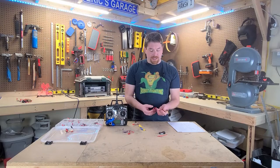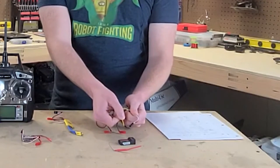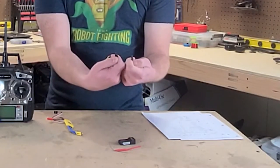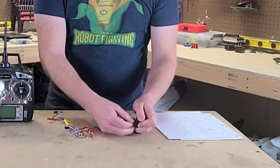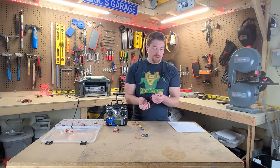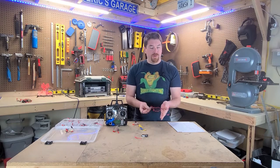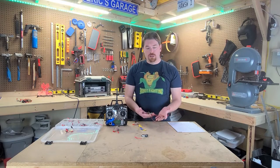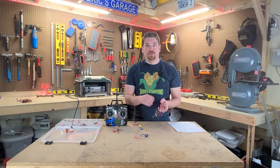This one here is actually a dual speed control. It allows for two separate inputs plugging into two different channels in your receiver. The receiver plugs — with the silver side up — into the three prongs on your receiver. This dual ESC hooks up to two separate brushed motors, which is very useful when you're worried about timing of your motor activation. It really helps when keeping a twin-motored robot running in the same direction with tank controls.